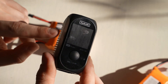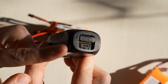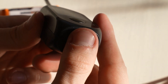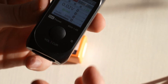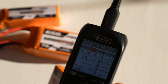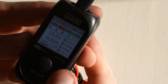If you want a little more granular control, the Toolkit RC M4 Pocket is the solution. You can input up to 80 watts of power and use either an XT60 or a USB-C plug — so 80 watts coming in. On the bottom they made the smart choice to offer both XT30 and XT60 for charging your batteries, and the balance port is on the side, which for small batteries can sometimes be hard to reach. With this charger you can charge LiPos and lithium high voltage batteries and also storage-charge those same chemistries. No nickel metal hydride or lithium iron, but you usually don't need to charge those on the go. You can go up to 5 amps of current, and it only has one button so navigation takes some getting used to.